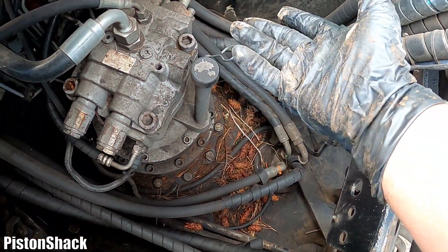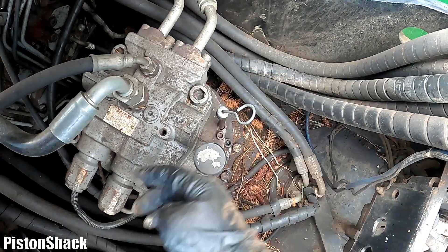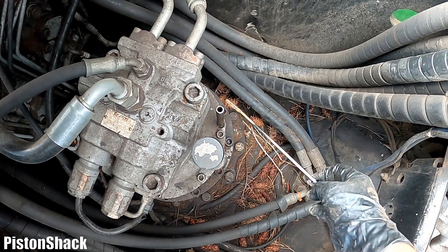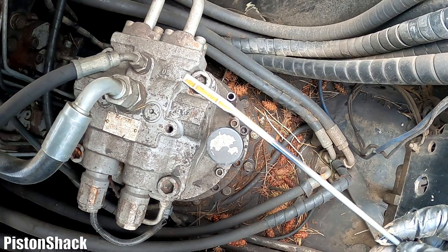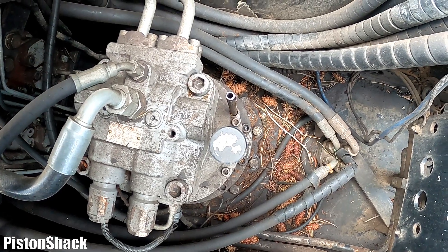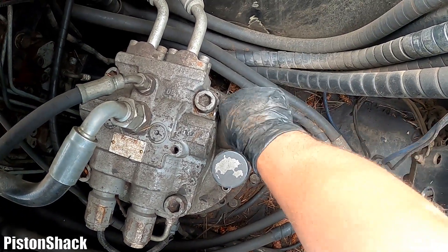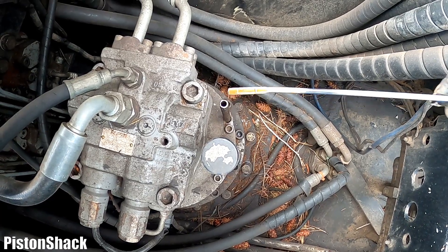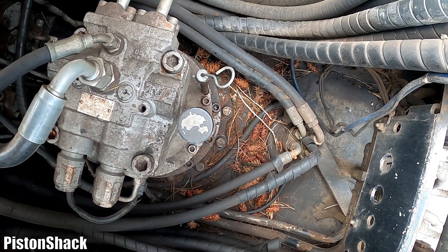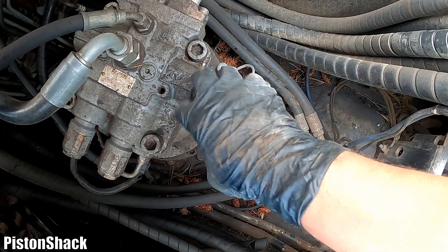The hydraulic swing motor is leaking. Normally you fill the gear oil and run the gear oil in the motor reduction part, but now it's all creamy — it's mixed with the gear oil and hydraulic fluid, and it smells like gear oil mixed with hydraulic oil, which is not good. As you can see, the level is rising. It's leaking and going inside the slewing tub, which is probably full of oil — that's where all the oil is going, and that's our work for today.